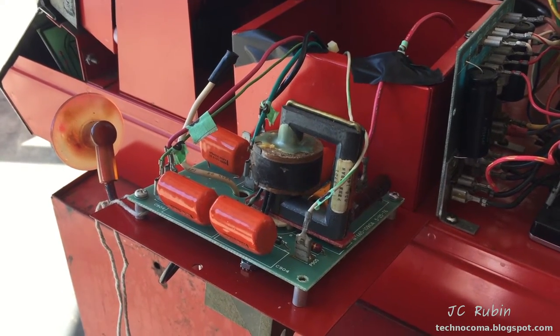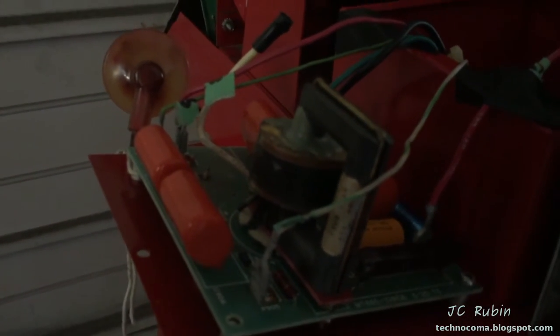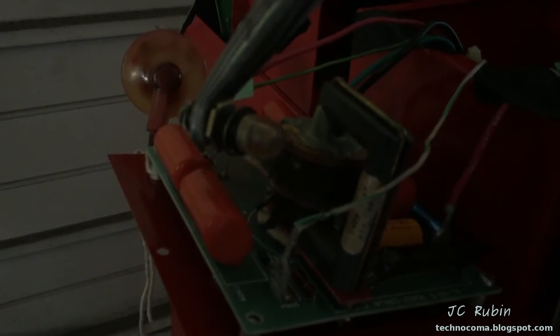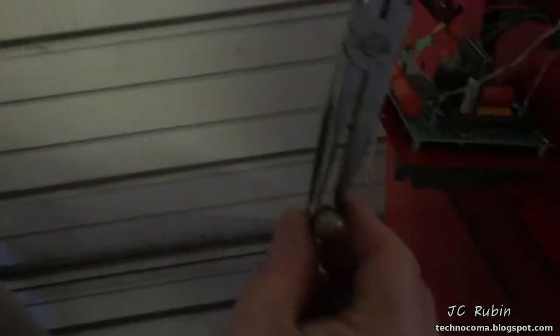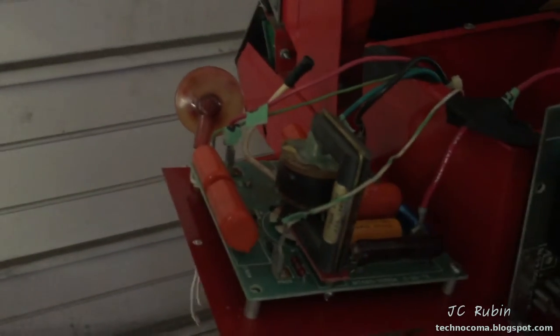Should we roll this inside and do this again so we can see it? So this is going to be the neon bulb just touching the outside of the coil — loosely coupled. We'll get nice and close to the flyback — not getting too close. Watch this — just near it. Did you see it? Yes! There it is — look at that. There's enough voltage there. A credit to my friend on EEV blog who helped me, and this is actually a trick we used in the Navy to make sure antennas weren't transmitting — using fluorescent bulbs. Look at that — it means it's working. That's working. Let's proceed with our next test, which we're going to discuss off camera.